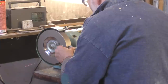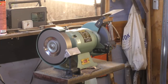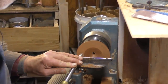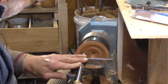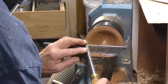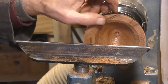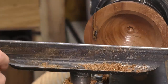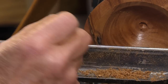I freehand grind. It starts on its side, roll slightly anti-clockwise to pick up the shavings. Now there's a splitter near the rim so I'm going to have a closer look at that. There's a whole line across there — and it's got an actual hole down in here, and there's a big patch of rot or something there. So I'm going to take it down to the bottom of that split.